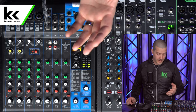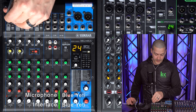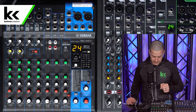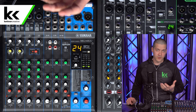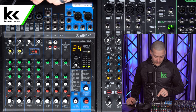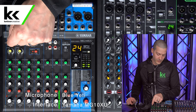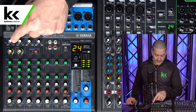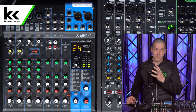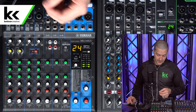A better way I prefer is to unplug from line five/six and instead plug the white cable into the first channel input. Turn the level up to the zero or unity position — here we have a proper preamp that helps set the gain better. I'll turn the headphone output down to 50% to reduce the background hiss from the Blue Yeti. With the level at minus 10, I'll turn up the channel gain until we're consistently hitting zero. The preamp is the best way to add gain to your recording, and I can see a similar output level from both the Blue Yeti and the Yamaha meter on my computer.